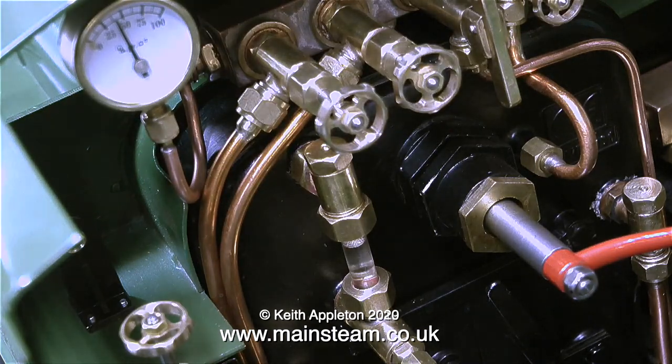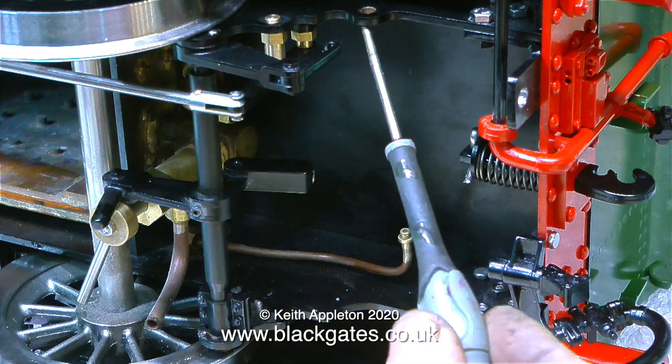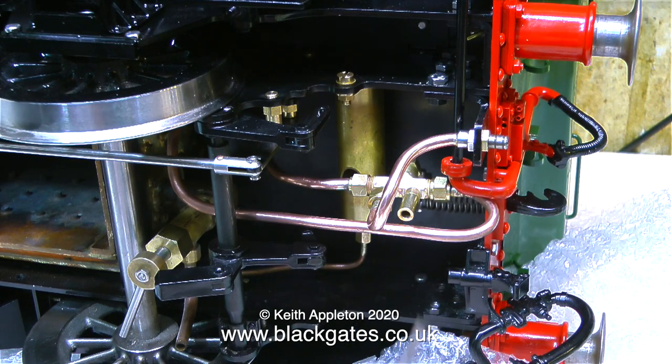The position of the injector itself is quite important. In this application the injector was originally designed to be fitted underneath, but it's a much better idea to have two steam valves, two water valves, and fit an injector at each side. Because with the injector in that position, without an extension on the overflow, you can't tell whether the overflow is running or the water is going into the boiler. A much better position is where the yellow hand is flashing — just underneath the running board at the rear. Also, if you need to remove the injector when the engine is in steam it's going to be difficult, and even though fitting an overflow pipe is a simple job, this is not a good position.